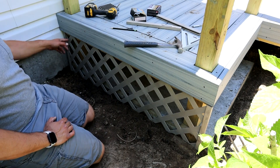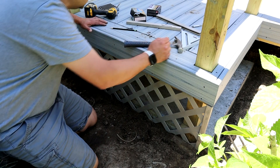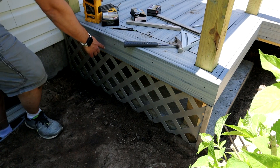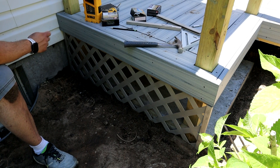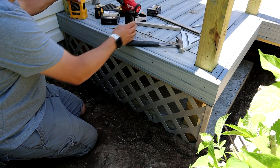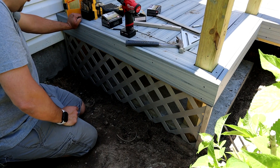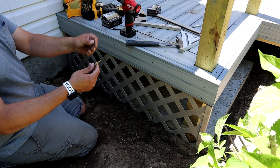Remember, I overran the skirt board a little bit, so there's nothing there to screw into, but I can screw the lattice in. I also have that block from the concrete forms that I just left in the slab down there, so I could actually screw into that too. To hold this into place, I'm just going to be using some inch-and-five-eighths deck screws. They sell special screws for this, but I don't think they're really necessary. The key is just to drill an oversized hole into the lattice — that way, when it heats up, it's got a little room to expand and contract. It's similar to installing vinyl siding: they tell you not to pound the nails in all the way, leave them a little loose so it can expand and contract. Same type of deal with this. We want the drill bit to be slightly oversized, but not so much that the head of the screw goes through the hole.